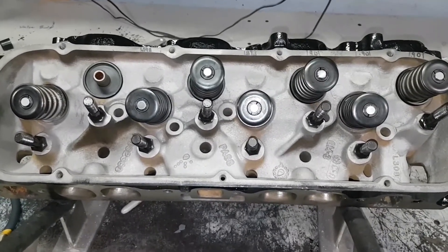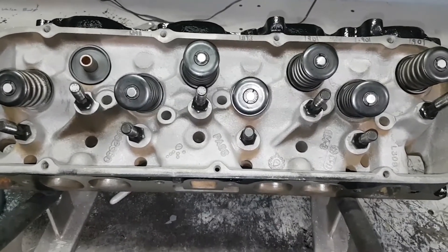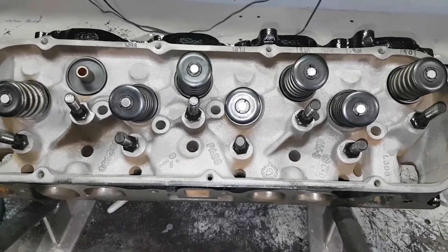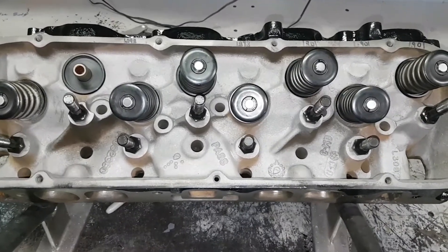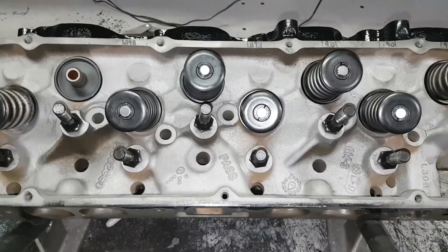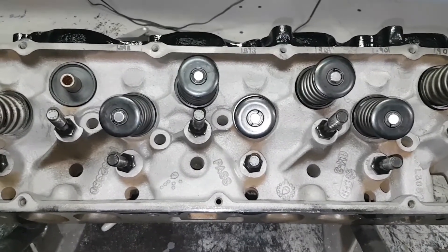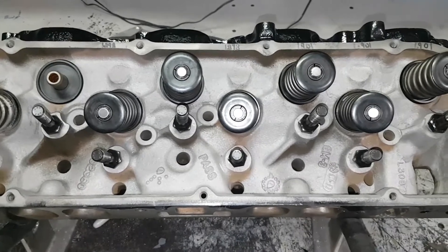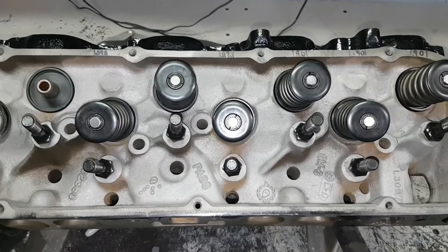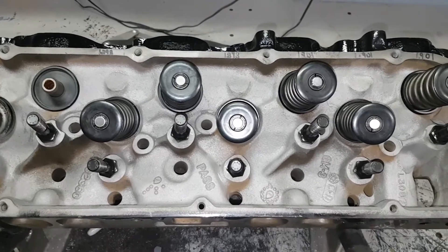If we took too much material off one, we could order a shim or find one in the pile to go under that eliminator to get our height exactly where we want it. I'm not really a fan of shims — if I can do it in one piece, that's a lot better. I usually order a couple extra eliminators when ordering them, that way I have one or two in case I screw up. You'll find that if you have them in the shop you won't screw them up — it's when you have a three-day wait for FedEx that you'll screw something up. So it's a good idea to have a couple spares.